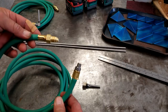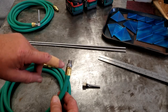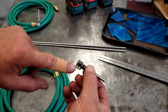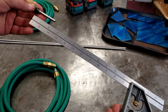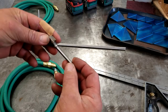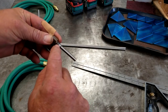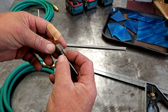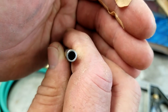This is all off-the-shelf stuff. I brought it out to a barbed nipple here, which is an eighth-inch NPT. For going down into the oven, this is the only piece I actually had to make — it's a street elbow TIG-welded to a piece of stainless steel tubing. From the center of the thread out to the tip is two inches, which is enough to go through the oven insulation. I'm going to drill and tap the insulation at quarter inch — same as the OD of the tubing — then tap the sheet metal at eighth-inch pipe thread. No pressure here, so we don't worry about it blowing out. It's 316 stainless steel tube.